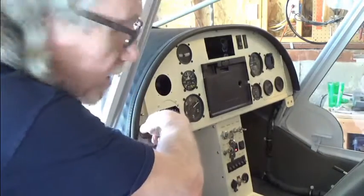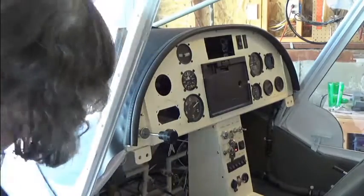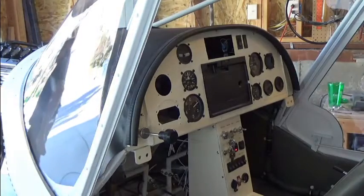I hear the motor running. We'll let it run for about five minutes. If you have a new exhaust system, it might smoke a bit — that's perfectly normal, just let it burn through. Before we shut the engine down, we're going to go through a specific procedure to make sure the alternator is able to keep the engine running. I'm going around to check for oil, coolant, and gearbox leaks. I've verified there are no leaks. Now I'll begin the shutdown sequence.